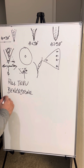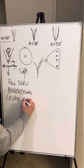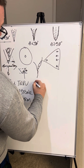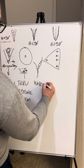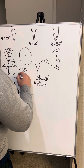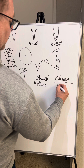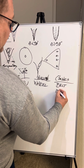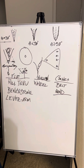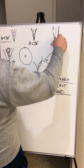Lever arm systems like KME and Worksharp and similar setups also tend toward flat grinds. Almost everything else has its pros and cons. The wheel system is almost entirely for hollow grinds. There's a whole video coming on how to do the convex by hand — if you know anything about parabolas and their math, that'll make it easier.